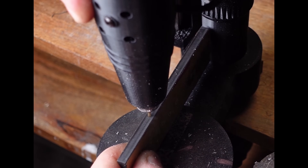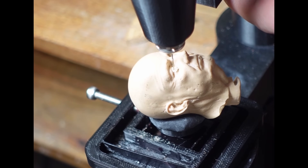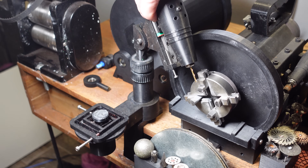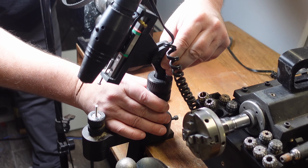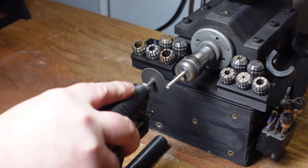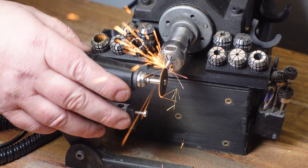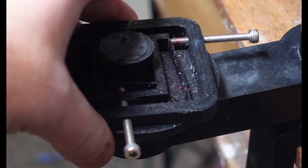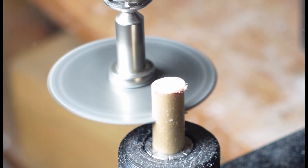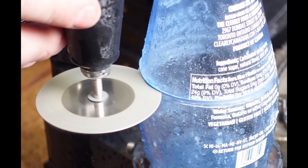The hands-free holder can be used as a mini drill press or drill guide. You can print a compliant mechanism to function as a mini cross slide if you need very precise drilling or milling. It can be positioned next to the lathe if you have something in the chuck you want to drill or mill, or the entire holder can be removed from the stand and bent 90 degrees — it has a flat bottom so you can position it on the table for a manual operation on the fly. If you need to cut something small and don't want to set up a dedicated saw, if it fits in an ER16 collet the stand lets you use the micro motor as a mini saw. And with a 3D printed rotary chuck, the holder converts into a glass bottle cutter.